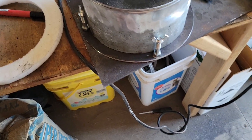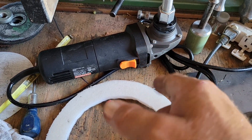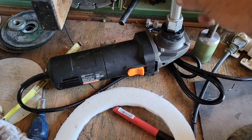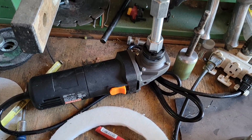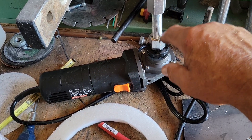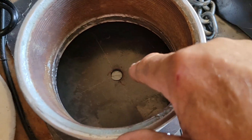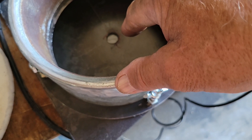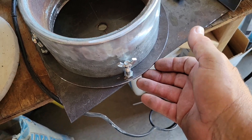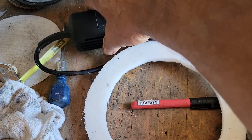So I've got my nine-dollar-ninety-nine-cent Harbor Freight four-and-a-half inch angle grinder with a five-eighths arbor, and then I've got my five-eighths bolt here and the connector that goes on it, with a couple of nuts. I cut one nut in half because this part will mount to the unit, and then this bolt will get cut shorter so this part right here ends up right up against that back plate — sealing the back end. The unit will be fastened to the plate with angle brackets and bolts going right through, and then there'll be an arm coming out that holds this part steady.